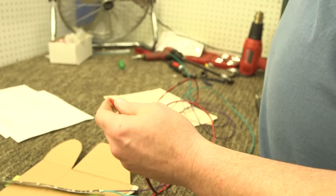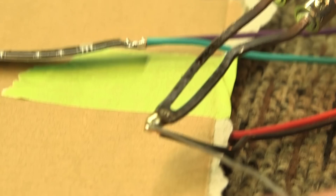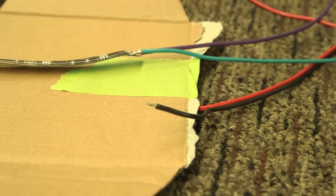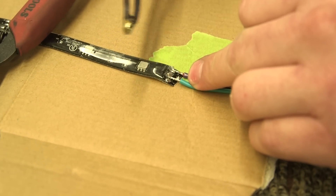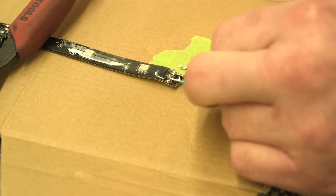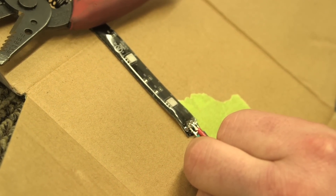You're going to want to strip back the wires pretty short — about an eighth of an inch. Then you're going to want to tin that to get the solder in there before you try to apply it. That way you don't have to overheat the LED strip. I've already stripped back the coating, the epoxy, and the silicone off the top of it so I could get to this. Sometimes when you pull it back it'll look like you're down to the end, but unless that stuff is shiny, you're not all the way down there — you need to keep peeling back.